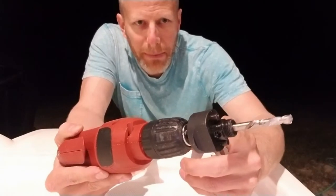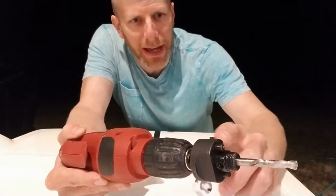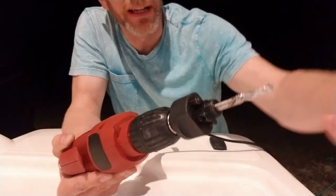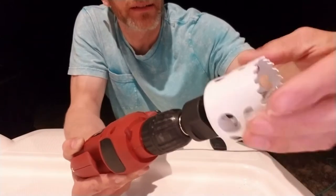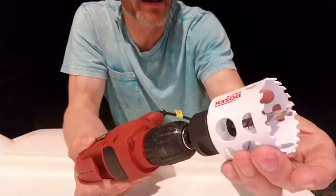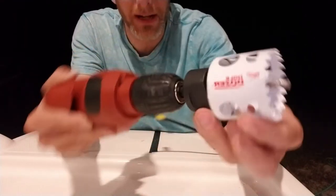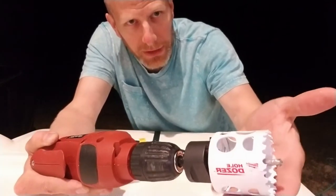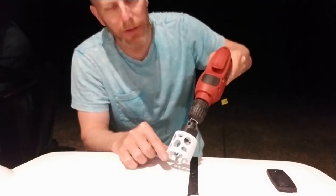In case you're wondering, you need this base piece - you can't just buy the hole saw, you have to have this arbor piece. It's spring-loaded, so you pull this down and thread the hole saw on, then push it back up until it snaps into one of those mini holes. Make sure it's snapped in before you start using it. Now, we've got the hole started - we're going to put this in and get the angle like we want.